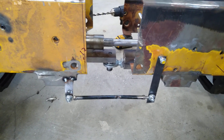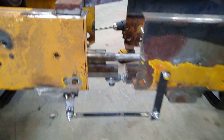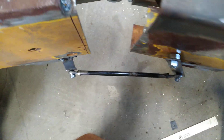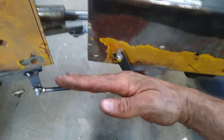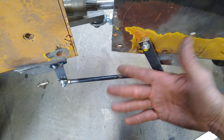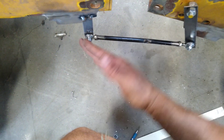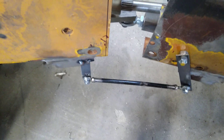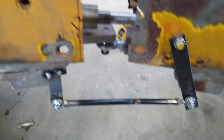What I'm discovering is that as this goes through its motion, the angles start changing pretty dramatically. As you can see right now it's pretty well lined up, but as soon as you go into a turn, all of a sudden I've run out of travel because the frame is like this and the rod is like this. So this rod needs to be able to come out this way more as it goes through more of a turn. Tonight I'm going to go on McMaster-Carr and buy some rod ends that are more like this — you see how it's got that little shoulder on the bottom — and what that allows is the heim joint to have more articulation.